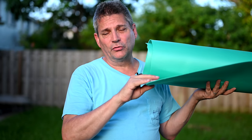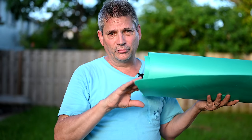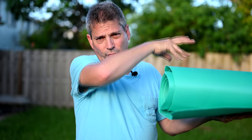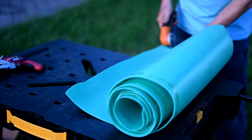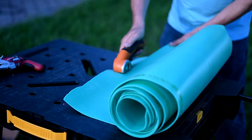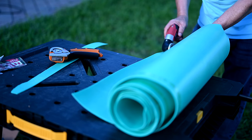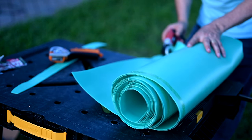This is eighth-inch thick underlayment used for click-lock or floating floors. You roll it across the entire room and cut it on your knees — having these electric cutting tools for this material is essential; I wouldn't do it without one. This is probably one of the biggest uses for these electric cutting tools. The WORX goes through quickly, nice and smooth. The Skill starts and stops — it's tearing at this point rather than cutting, though if you can get it started it sometimes goes.